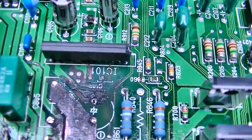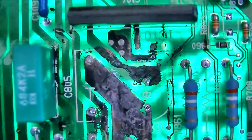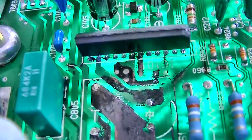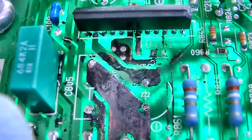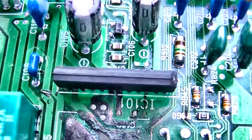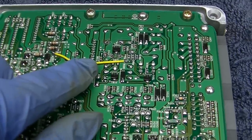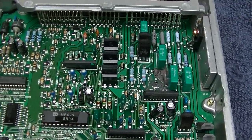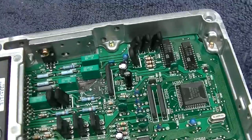The third or fourth pin goes directly to that capacitor and that capacitor only. I'm not quite sure what to do — there are other capacitors in this circuit, but I don't necessarily want to start removing and measuring them all. I got these two capacitors reinstalled and replaced the broken trace. I'm double-checking using the Cap Wizard because it's great for checking low-ohm loads. I'm good here. The mystery remains: the missing capacitor.